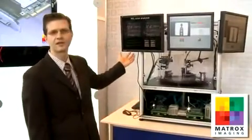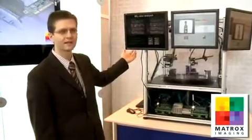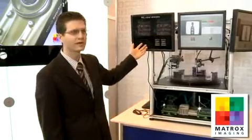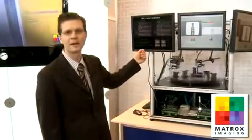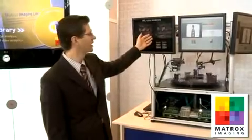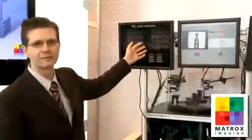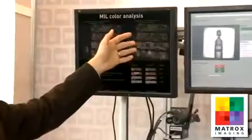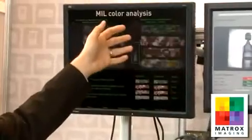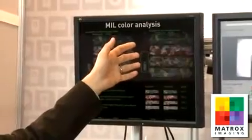The demo was put together using our Matrox Imaging Library, using the latest update, which is called Processing Pack 2. What this demo is showing is the ability to do histogram-based color matching. The demo works by first locating a fiducial using our pattern matching module, then using our new fixturing capability, placing 4 regions where we will perform the color matching.